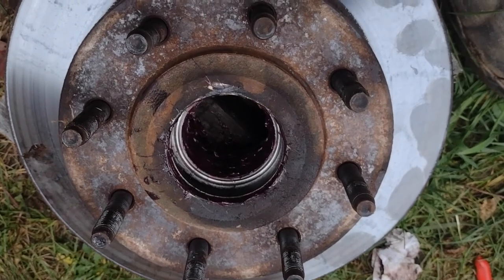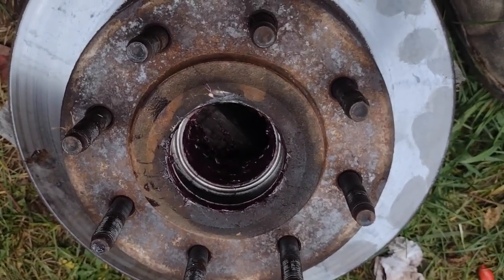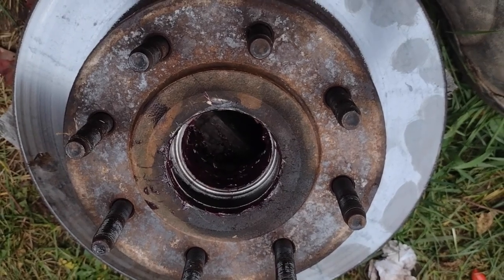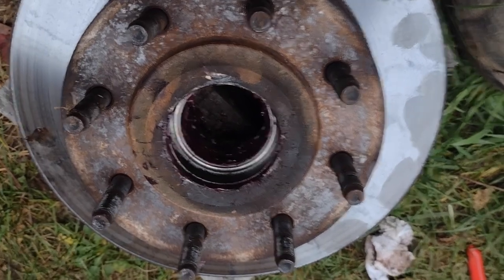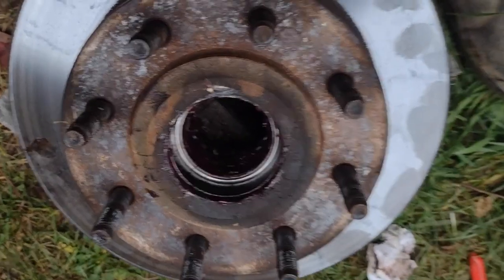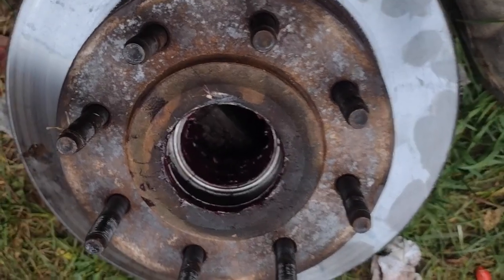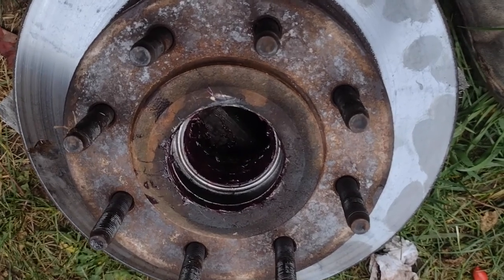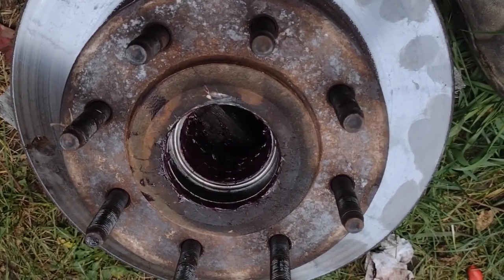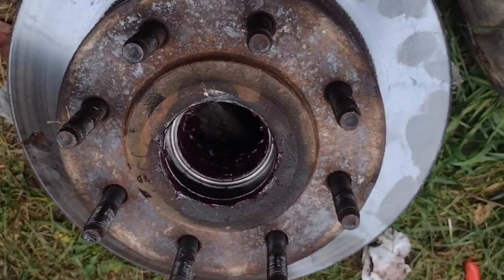If there's one mistake that people make having to do with the finances of repairing stuff, it's that they don't fully understand how much it costs when things break just in downtime. It must be avoided. In this example, that means that all the bearings, all the races, all the wheel seals get replaced. In other examples, it means that when the factory says that the fluid in this thing has to be changed every 500 hours, we actually change it at 500 hours.